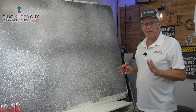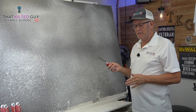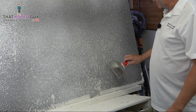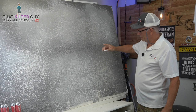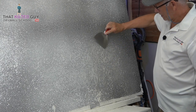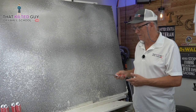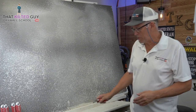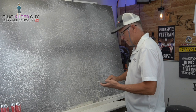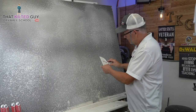I normally highly advocate the use of a Lexan knockdown knife — I think they work the best of anything I've used. Steel knives are going to flatten it quicker, and this one may still be too wet, but with really light pressure I can get some knockdown there. With metal knives you have to have the lightest touch. I'm just barely holding this to barely put any pressure, because they will flatten the texture out in a hurry. This still needs to set up just a little bit longer and then we can go ahead and get that.